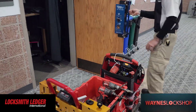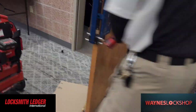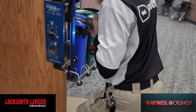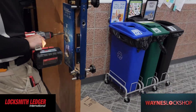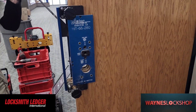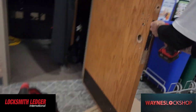Josh is going to put that jig on the door and we're actually going to get live video footage. You'll notice that he has a nice cart set up — we've got a lot of Milwaukee Packout tools and drills set up with different drill bits already attached. It did call for the 2 and 1/8 inch hole saw on this one. He then has another drill chucked up with a 3/4 inch drill bit, and one chucked up with a 7/16 inch drill bit as well. You can see the holes are drilled extremely quickly. We also have a longer 12 inch drill bit to drill that door position sensor out.